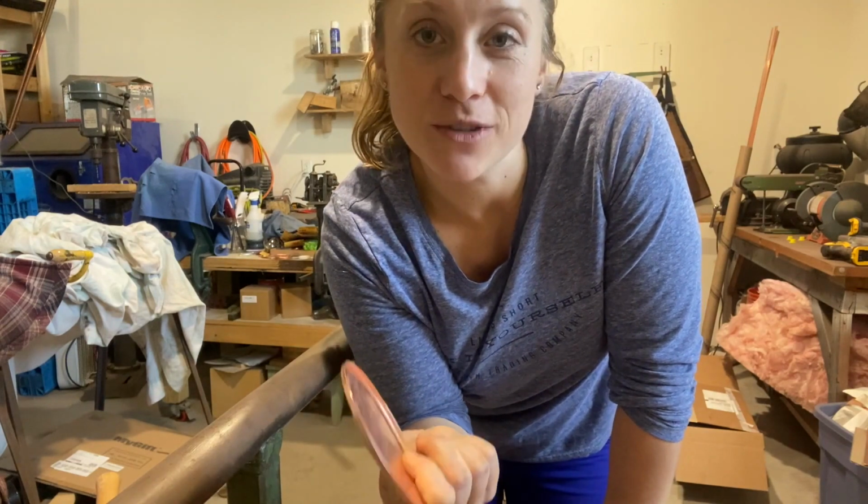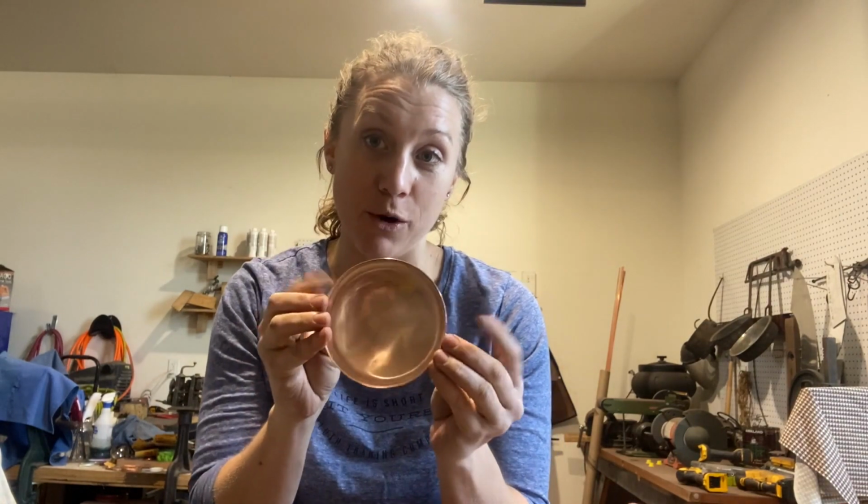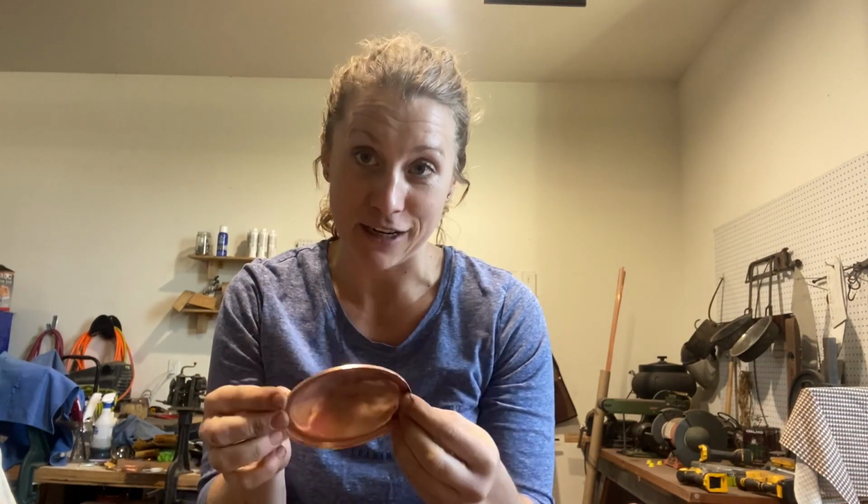Now, the next thing to do is a rim band. When we make a rim band, you need to take the diameter of your piece. We have a 4-inch circle, essentially, now that we have used up that 1/8 inch on both sides for that 1/4 inch extra. So the interior diameter of this is 4. You take your interior diameter times pi.